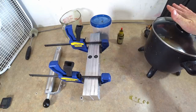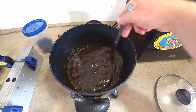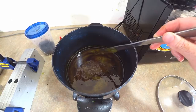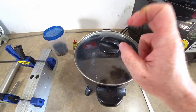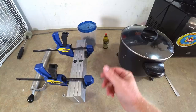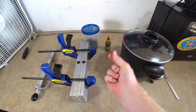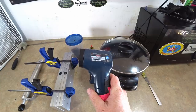About seven or eight minutes in now. One thing I've noticed about the new Dead-On plastic is that it gets to the gel stage really quickly - so quick that a lot of times guys take it out of the microwave and it looks ready to shoot but it hasn't completely kicked over yet. That's why baits come out sticky and don't set up. You need to make sure you see 350 degrees at least once before you actually shoot your baits.